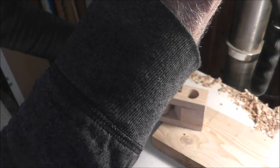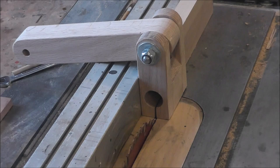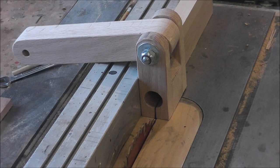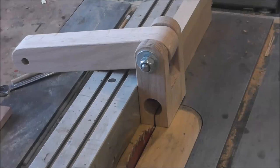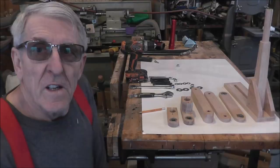The drill won't go all the way through, but it'll go into the bottom one. I'll disassemble it and then continue drilling. It's just a matter of turning it on, marking the place where your hole is, and start drilling. While I had it all together, it was time to cut the slot so it can be tightened onto the post, using a backup board as I ran it through the saw. Now I just have to drill a cross bolt hole for the tightening bolt.